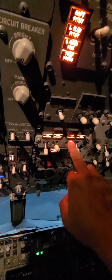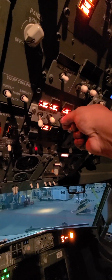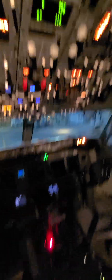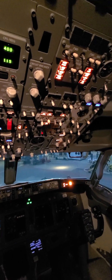Next, we have electric one hydraulic pump for the brakes. The accumulator is straight in front of me — right there. Right now I have about 2400 PSI. When I turn this switch on it should go up to 3000 or about 3200. We need a minimum of 2700 PSI in order to tow the plane. So that's good. Now we can tell the ground crew to remove wheel chocks because we have brake pressure in the accumulator.